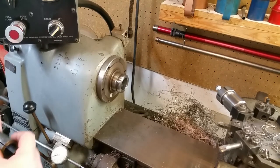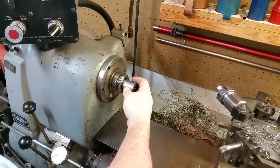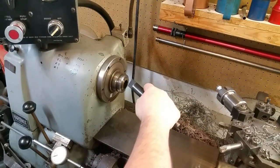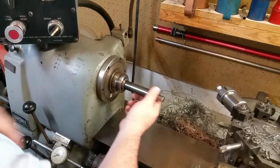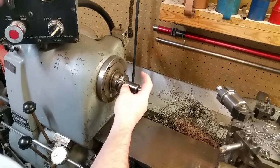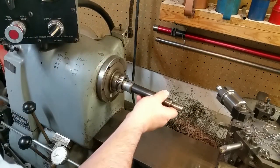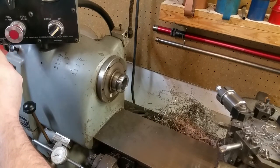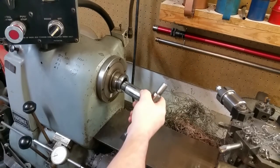The next step is to select a collet. Make sure the collet's reasonably clean. This spindle has the little drive key. That's a one-inch collet, I believe — though it may not be a one-inch collet. I'm not going to worry too much about it right now. It looks like the collet's a little sprung. It's a hardened collet, so we'll just go with it.